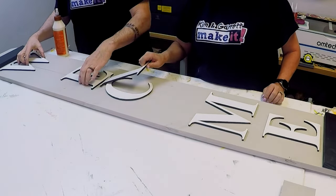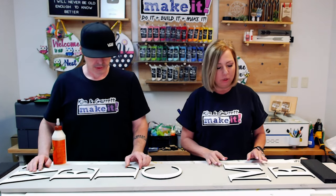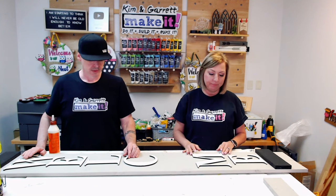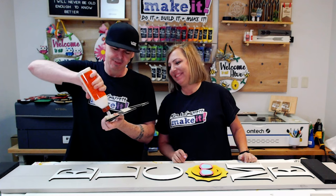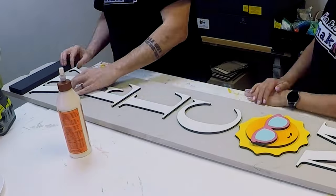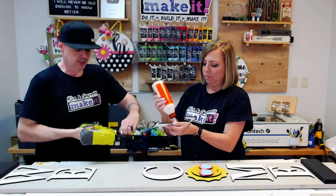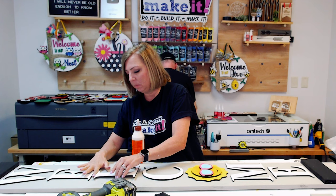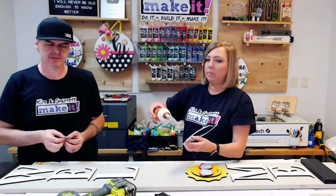There's a realization that a letter might be missing — specifically an 'O' — but since the magnet will be positioned there for the interchangeable accent, placing an actual O would look weird anyway. The letters look great. Wood glue is used to glue them to the wood, and the brad nailer is switched down to half-inch brads to avoid shooting through the back. Nail holes are filled using a micro-tip dipped in white paint.